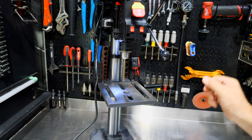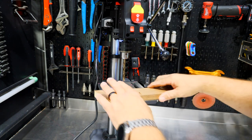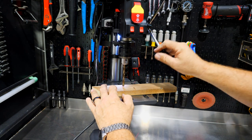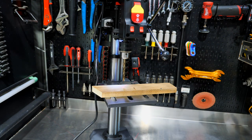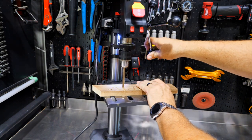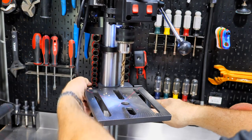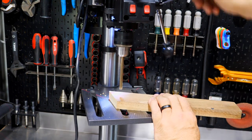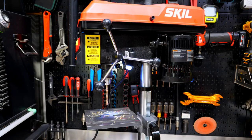Now we're ready to drill. If the laser is off, always test to confirm your drill bit meets the X dead center. If not, take the small plates off and adjust the laser to where you need it. Then turn the table and you're hitting the hole.